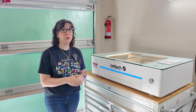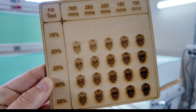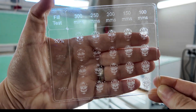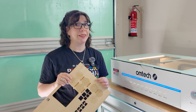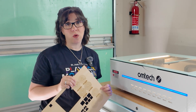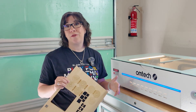The spreadsheet will give you a good starting point. However, you're going to want to do tests on your own because every laser is different. You always want to do a material test. These material tests help you identify what power-to-speed ratio you need to get the results you want. Here you can see the outcome of the material test I did on wood, and here's the acrylic test — might be a little hard to see because it's clear. The last test I'd encourage you to do is a concentric circle test. Once you've dialed in the settings for a score line on wood, you need to do this test to ensure you don't have wobbly lines.